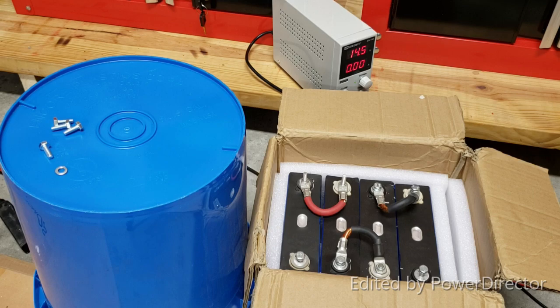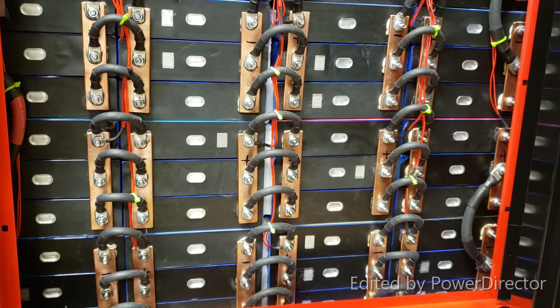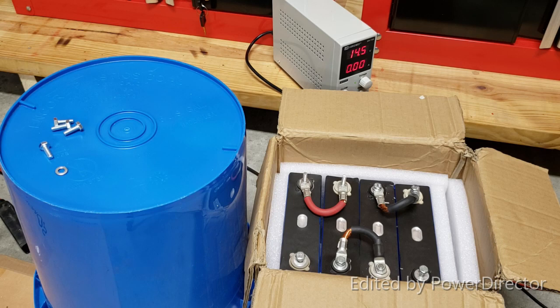Well, hello everyone. But if you bought something that was used, you better go ahead and charge each individual cell separately to a full state of charge before hooking them up together. Today, we're going to be talking about charging batteries, charging the cells, charging the modules, charging your BYD pack or whatever you purchase used off of the internet.